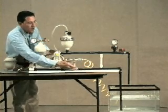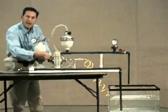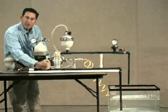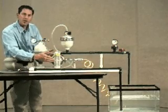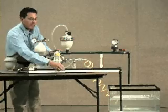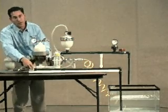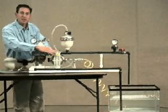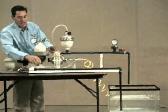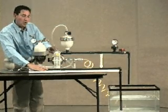As the pump strokes, the acceleration head is headed towards the pump. The ball valve closes, stops that flow, and reverses it. On the next inlet stroke, the pump must overcome that pressure wave going backwards, re-energize the fluid forward, back into the pump. That creates a lot of stress on the pump and its components, including the diaphragms, and bounces around the inlet piping and hose.